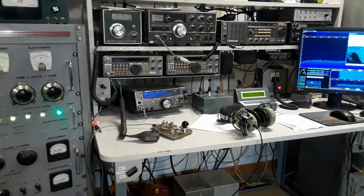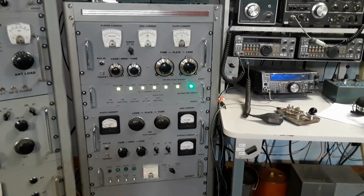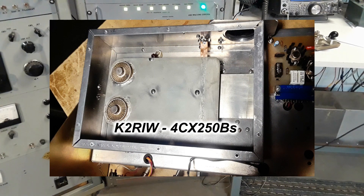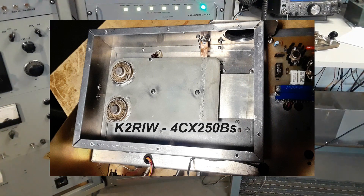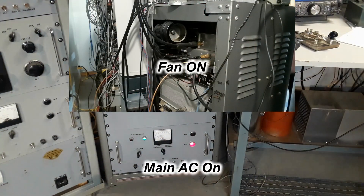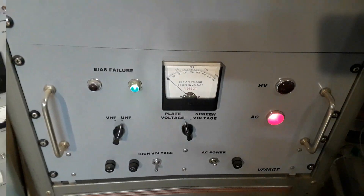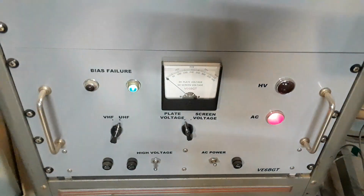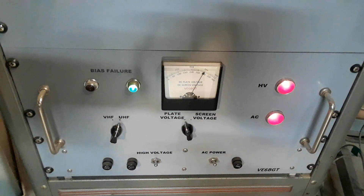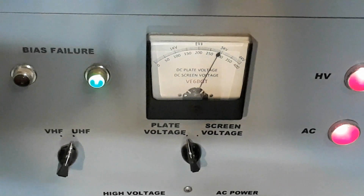So back in the shack - nothing you haven't seen before in other videos. Just mainly get down to the UHF amplifier and get it powered up. This is an amp I built many, many years ago. It's the K2RIW design, and mainly consists of just a pair of 4CX250 very rugged tubes. So after a good warm-up time of the filaments, it's time to flip on the high voltage. This high voltage for the anodes of the tubes with no load is straight around 3 kilovolts, but under load it drops to just above 2 kilovolts, somewhere in that neck of the woods.